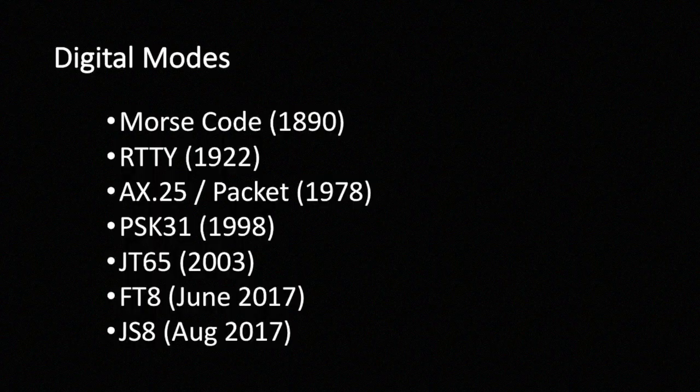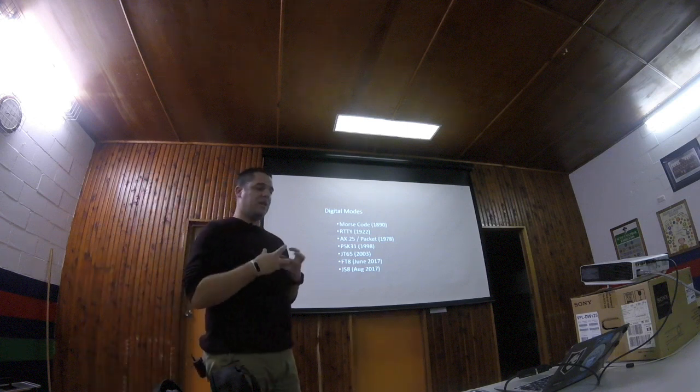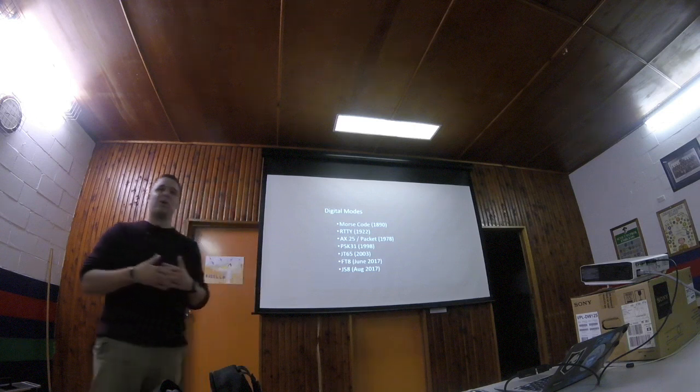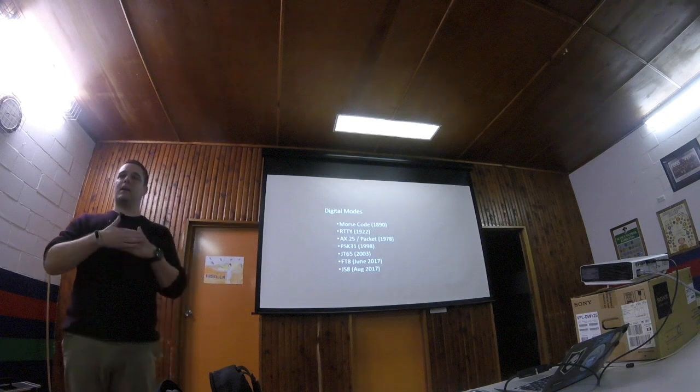So, digital modes. You know, we had Morse come out in 1890. Then we had RTTY in 1922, AX.25 in 78, PSK31 in 98, JT65 in 2003, and then FT8 came out in June 2017, and then really quickly after that, Jordan, who is the head programmer who actually designed JS8, brought it out within a month. It's actually built on the skeleton of WSJT-X. That does all the FT8 decodes.